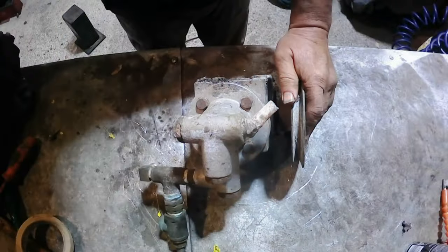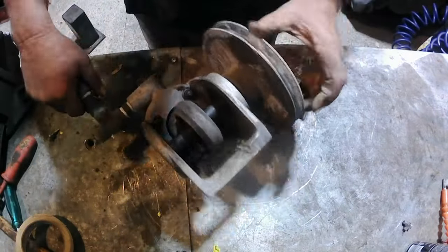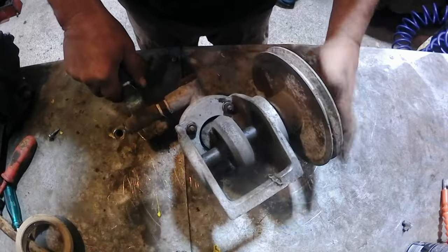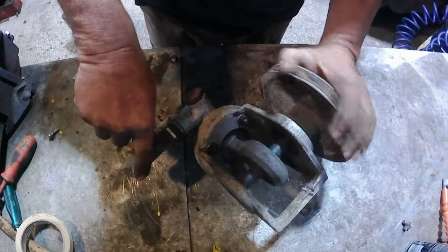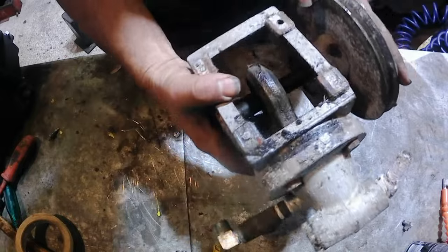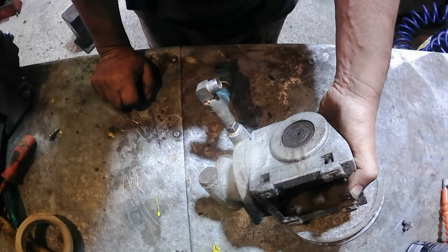Okay, onto the pump. It's an aluminium pump. Has a little piston and plunger in there, so as it turns, it just moves a small rubber diaphragm, which looks intact. I think it might be okay. What we'll do anyway, the first job, if you remember when I took it apart, I snapped off three bolts in the base. So we need to drill them out.